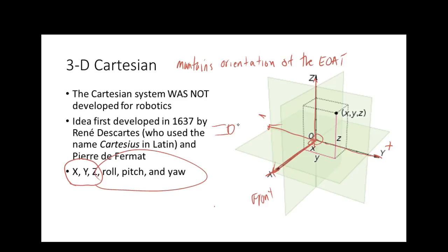Have you ever seen some of these planes coming in for a landing when they've got a crosswind and the plane is actually flying like this? It's not turning. It's still flying that direction right there. All they did was move the rudder and cause the plane to yaw. And then that way they're moving into the wind, and right before they land, they'll whip the tail back around and straighten the plane up. So what they're doing is yawing the plane. They're not trying to make the plane turn. They're just trying to make it change direction.